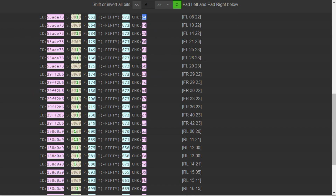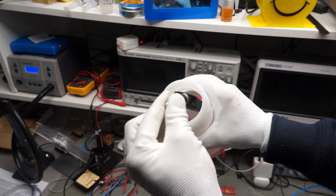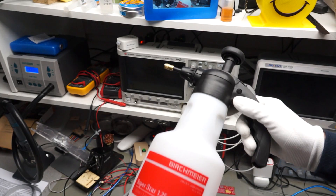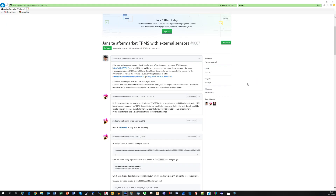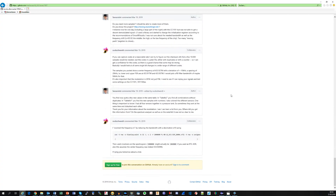I quickly found out that the procedure with a bicycle tire is tiring and upgraded to a Swiss-made pressure chamber. It has an opening big enough for my sensors and creates a pressure of up to 3 bars, and it fits in the fridge for temperature changes. Fortunately, we have an automatic tool readily available for 433 MHz sensors — it is called RTL-433 and it already knows a lot of sensors and immediately decodes their values. After you saw this video, you can imagine how much work is hidden in this software. And every week, more is put in. I was lucky that Christian, the creator and maintainer of the program, took my samples, analyzed them and augmented the code so it can also decode these sensors.